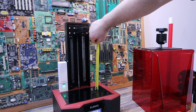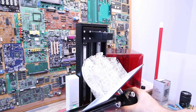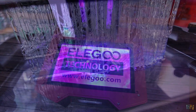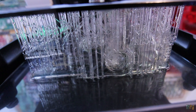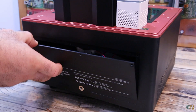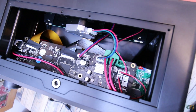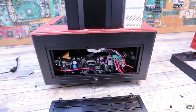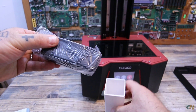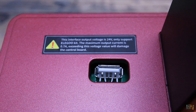The height is also quite big — 250mm — so you can get pretty tall prints with this machine. The display is monochrome, so the exposure time can be very low, from 1 up to 3 seconds, so you can finish your prints quite fast. We have the power plug on the back, just in the middle of the printer, and you also have this lid that you can take out and access the main board if you want. They now included this USB powered air purifier to lower the fumes from the resin. Note that this USB connector is only for the air purifier.